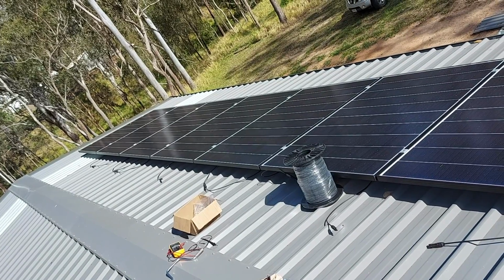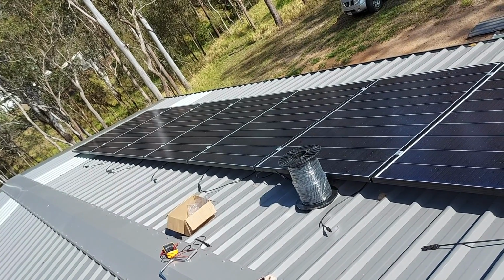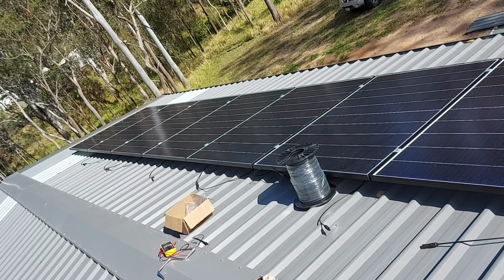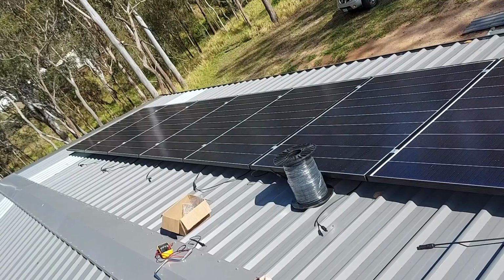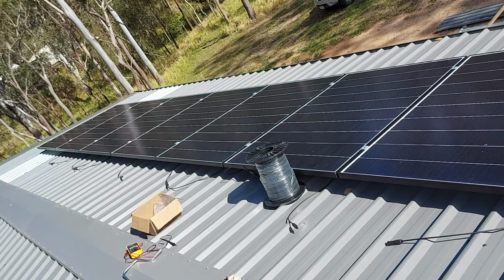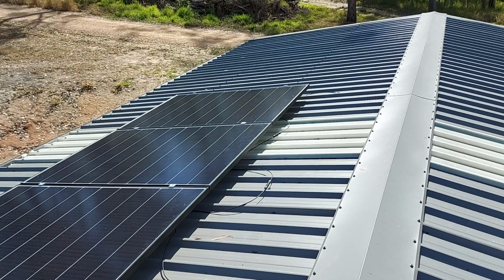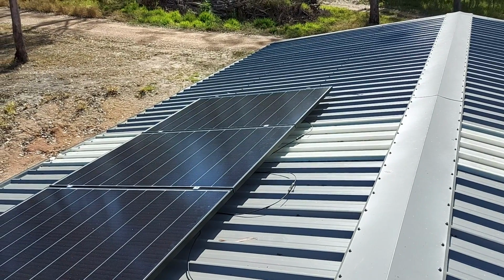This morning, before it gets too hot, I'm running the cabling here. So I'm running 3 in series, and then another 3 in series. And then I parallel those 3. But I do that again because there's 12 sets of panels. So, ready to run the long cable up to the combiner box up there, the isolation box.